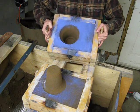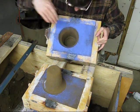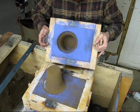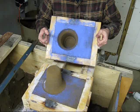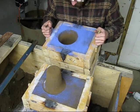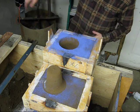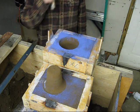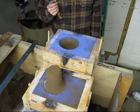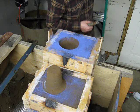The cope — if you can see the cope — is actually fairly sturdy in here. The cavity looks pretty good. There will be a few defects that I'll have to compensate for, but it's not too bad. And like I said, this is all getting machined. If I had to leave an as-cast surface on any portion of the bell, I would probably be a little bit more meticulous in making sure my mold was up to par.